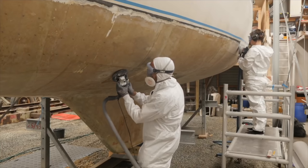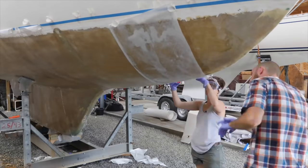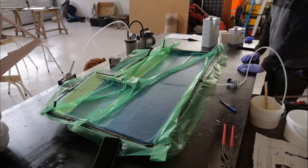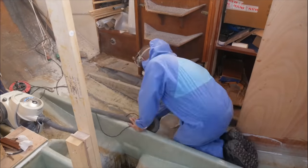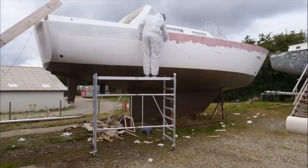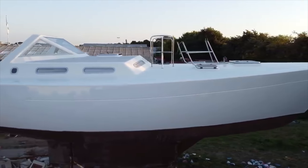If you're new to our channel, my name is Mads and this is my fiancée Eva. I've spent the last five years doing a somewhat extensive refit on my 1987 Warrior 38 named Athena. That involved building a new rudder using vacuum infusion, gutting most of the interior for structural repairs, rebuilding most of the interior, and also rebuilding the entire deck and painting the topsides. All of that is documented in hundreds of videos here on YouTube.